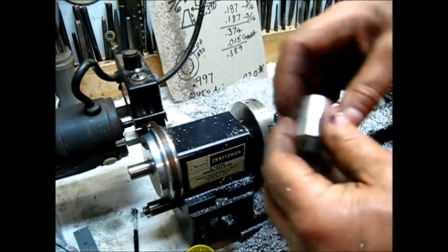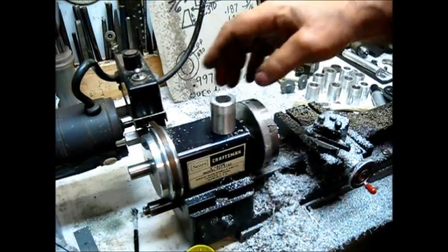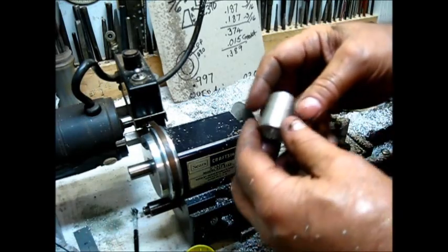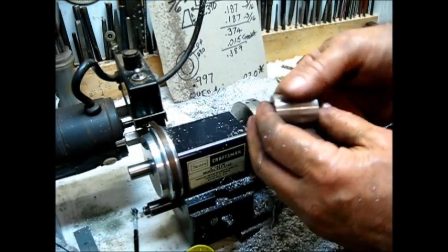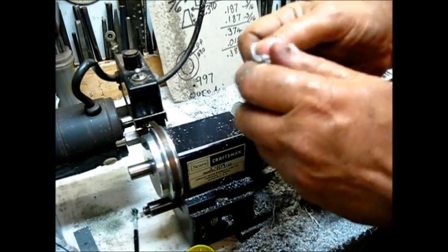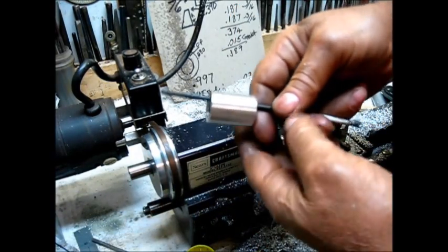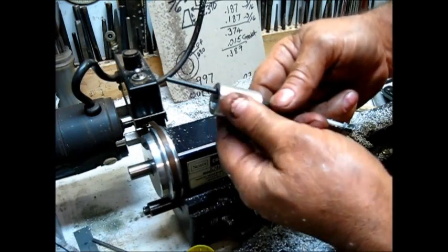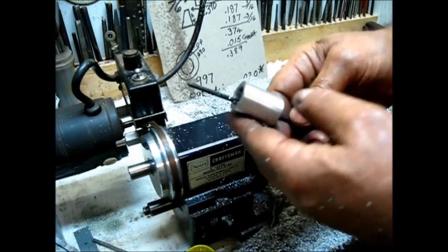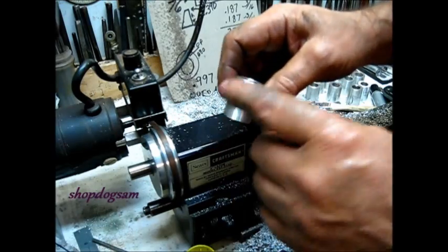As you can see, that's pretty good. The matching lines — that's where you can tell if your lathe is in true and your chuck jaws are in alignment — is when you make two opposing cuts and they match up. If your lathe will do this right here, you got a pretty good lathe. I can't feel it but I can see it. The finish — that's pretty good. Don't matter who done it, that's pretty good.